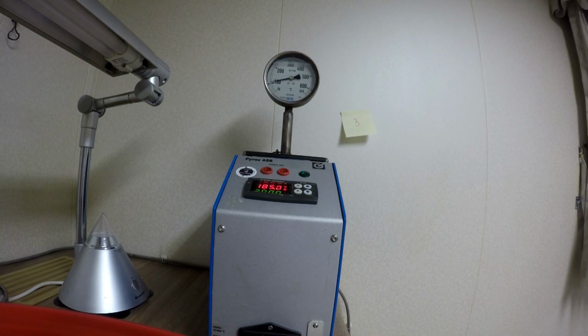All engines have an effective load at which they produce the maximum power output and have the least consumption per kilowatt of output power produced. As you can see, this kind of calibration takes a lot of time, and this video is in time-lapse mode. It's really quick, but normally this takes about 2 or 3 hours to calibrate all 6 temperature indicators of the engine.